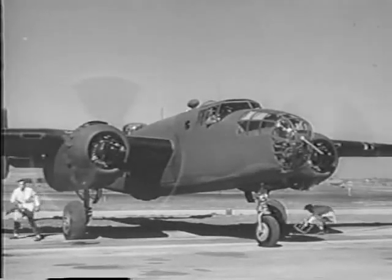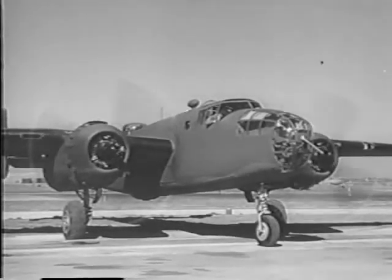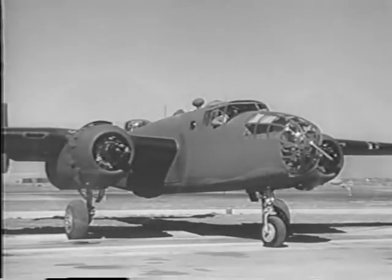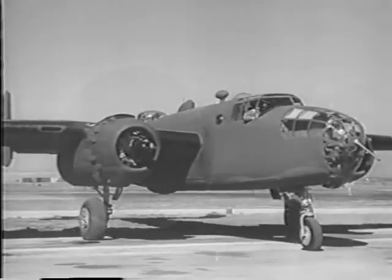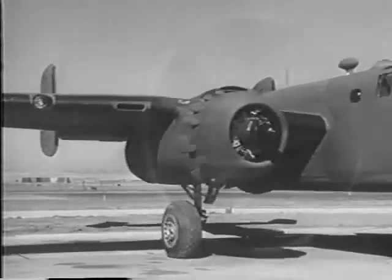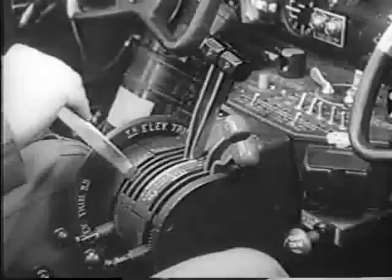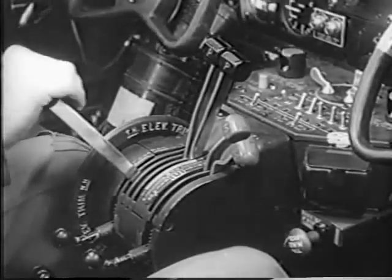If your magnetos check okay, you're about ready to go. Make a final check of cylinder head temperature, oil temperature, and oil pressure, and you're ready to contact the control tower for permission to taxi. When you get it, have your chocks removed. Release your parking brakes, and you're on your way. You don't try to turn before your ship gets moving — to do so would put dangerous side stress on the nose wheel. Use your brakes cautiously until you're familiar with their action. Brake pedal forces are light and don't build up in proportion to pedal travel, so steer with the throttles as much as you can.